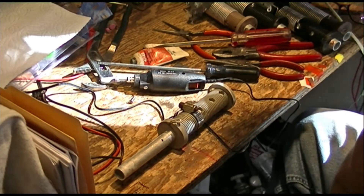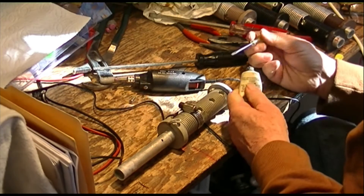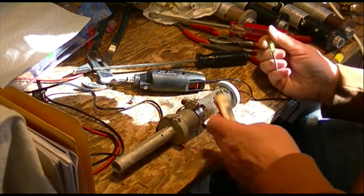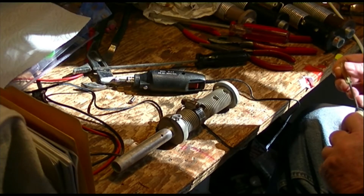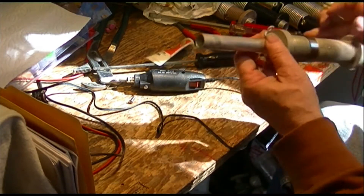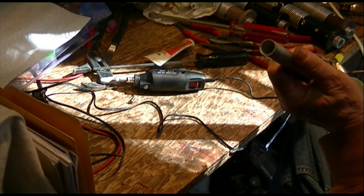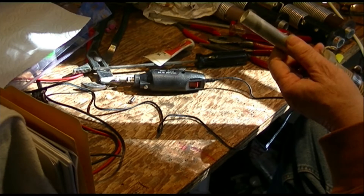So a very highly technical cleaning process I have - I blow some air on it. Anyway, I'm in a fine mood today. You want to get plenty of that goop down in that recess, and if it goes down the hole and gets on the threads a little bit, so much the better. You don't need to slop this around, but if there's a little bit of excess you can always wipe it off with a paper towel. Just make sure you've got plenty of it so when you put it in there and tighten it down, it's going to ooze out and squeeze out the edges - if it didn't do that, you didn't put enough on.